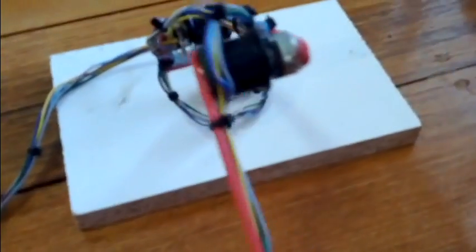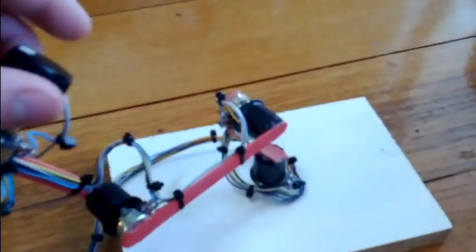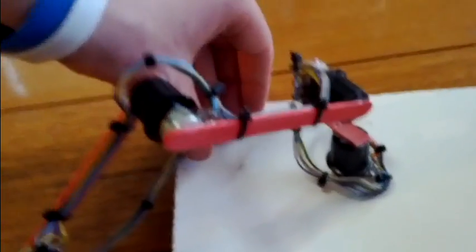I'll plug the Arduino in. These wires go all the way across to this little controller thing, which is just hot glue and paddle pop sticks, cable ties, pots, and lots of wire. The idea is there's one pot for each of the joints. The Arduino just reads the analog value from the pot, scales it, and outputs it to the servo. It also checks a tactile button on the end, which turns the electromagnet on and off. It's all just hot glued together.